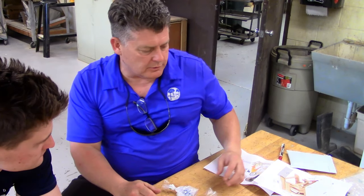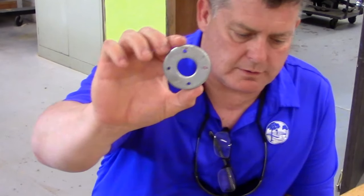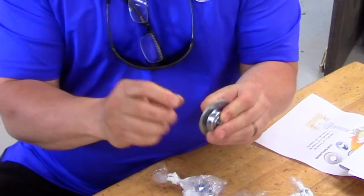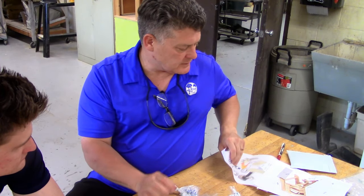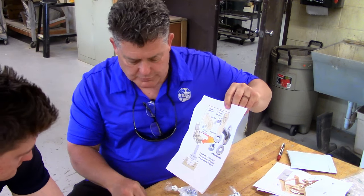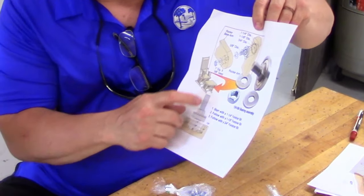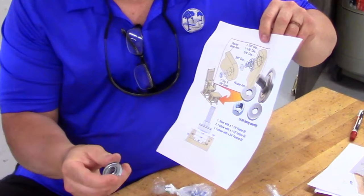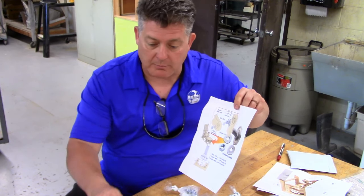What Andy and I are going to do today is I have these larger bearing caps. This is going to go over the top of this, and that's going to screw into the wood. It's going to help hold the bearing in place. So you can see this picture here. They call for putting screws just to hold the bearing ridge down, but I'm upgrading to putting a cap over the top of that so it holds this thing in evenly. This is gonna have a lot of weight on it. I want it to last for a long time.